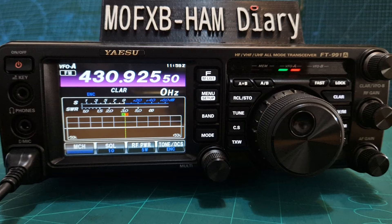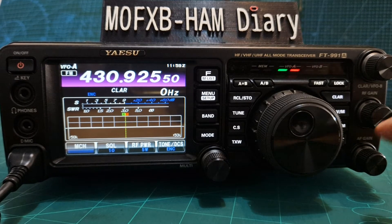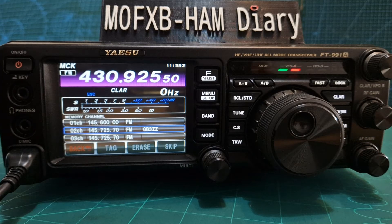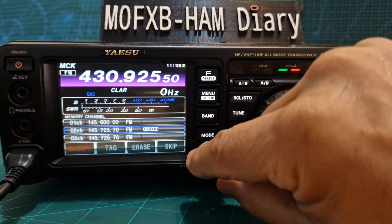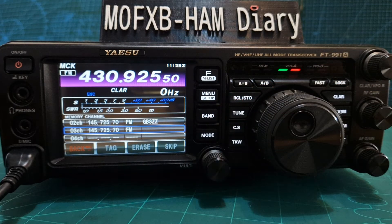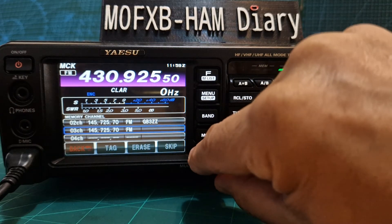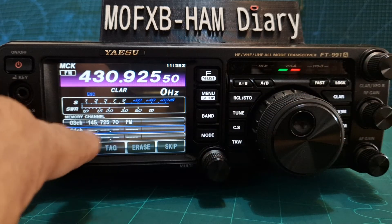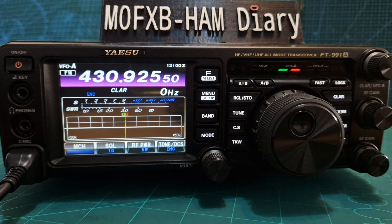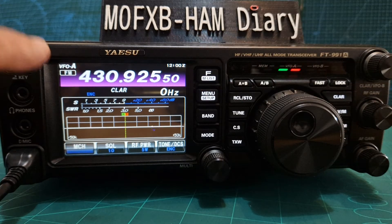So we've got it all in there. The next thing we want to do is add it to memory. Push your AM button just once and you'll get a list of your memory channels. Use the multi knob to turn down until you get to a blank one — which is number four. Make sure it highlights it in blue, then hold down AM again. It will beep twice. It's now in memory channel four but we're still in VFO mode.